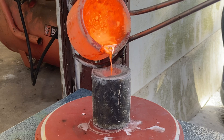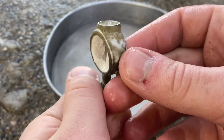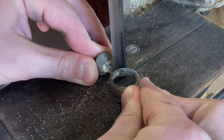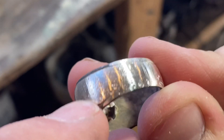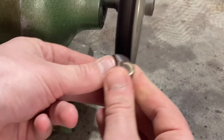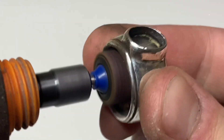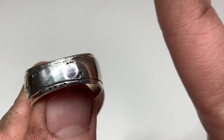This is one of the cleanest pours I've ever done, and after a quick bath to cool down it looks like the ring itself turned out pretty well too. Now with everything difficult out of the way, it's time for cleaning. I started by cutting off the metal bar, cutting off the sprue metal, and sanding it back down to a uniform shape. The metal ended up being a lot more porous than I initially thought, but it's a defect I can definitely live with. We'll give it a quick polish to get our first look, and it's already looking just beautiful. I'll use my hand files to cut the grooves back in and give it a polish.